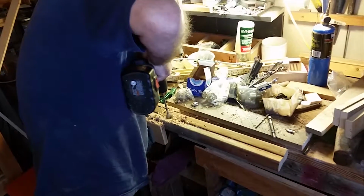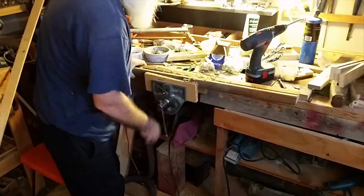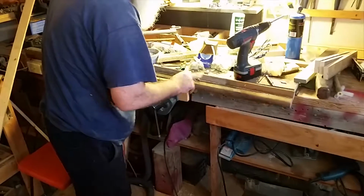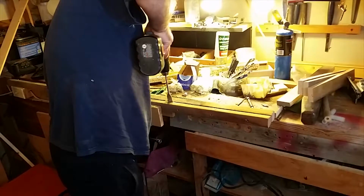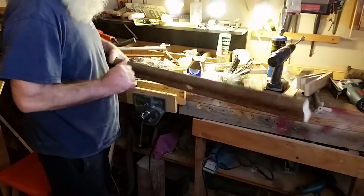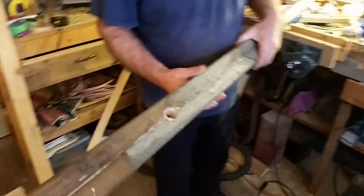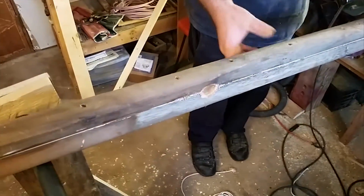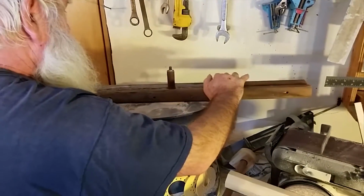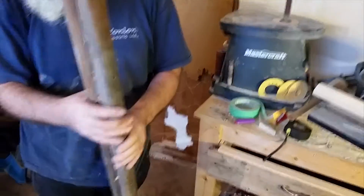This piece of material we're using here is roughly a 2x2. I think it might have been a banister railing for a staircase at some point, but we're basically gluing and screwing it together so that it's more like a 2x4. We figured the fact that it's laminated might make it a bit stronger, and we're drilling out a 1-inch hole for the new shaft. This hole's a little bit tight, so we'll hit it with the sander just to smooth out the inside and make sure it doesn't bind up when it's pivoting.